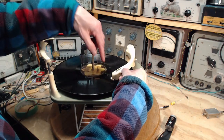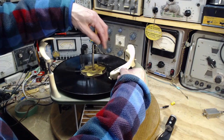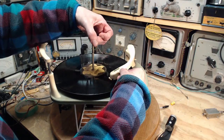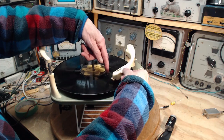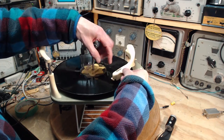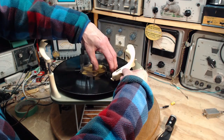When it's on the normal grooves, it's traveling very, very slowly, and the record player is going to ignore that. But if it senses that this is traveling at a higher speed, then it will try lifting it up. That's why when you swing one of these towards these grooves, the mechanism leaps into action before it gets there. Because it's not where it is, it's how fast you're moving it. And this velocity sensitive system only works in the last, say, third of the record.